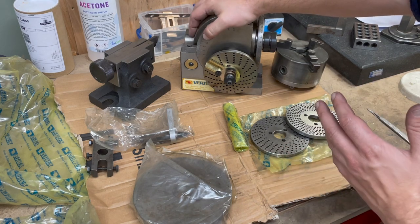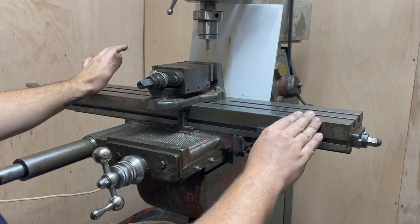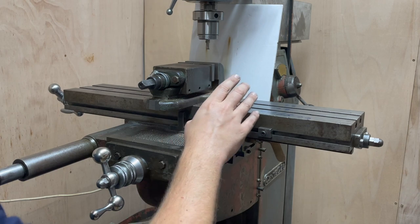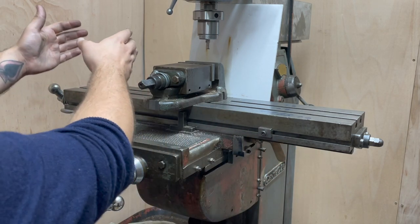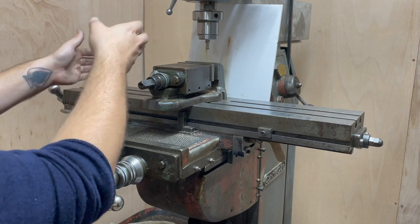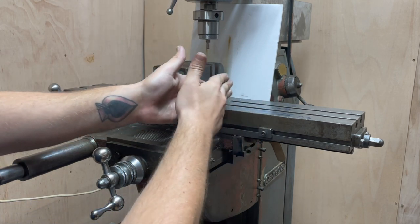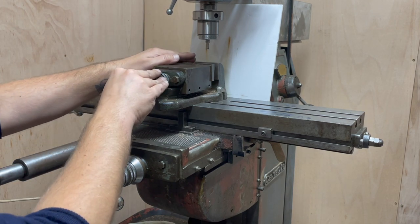So I'm hoping to get this in action on the mill. This table has the gib adjusters on the back — I need to sort out any slack in there, because while the table is fairly easy to move, I'm noticing there's about five thou of rock in the table this way. As it moves to the full extent one way, this side comes up, and the other way this side comes up. In the traditional use of a dividing head on a larger mill, you might mount the dividing head on one side, have it trammed in over there, and only bring the table across when required. Because this table isn't ginormous — it's only about 25 inches — I'm not sure I can get away with that. I might be able to shift the vice over to one third and have the other two thirds for the dividing head, but I think in reality the simplest option will be to remove the vice when I want to use the dividing head.